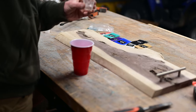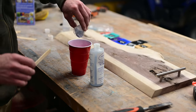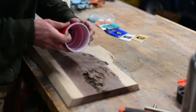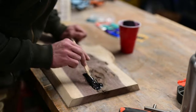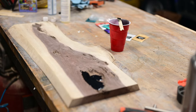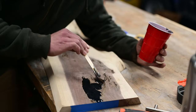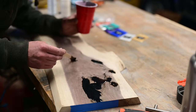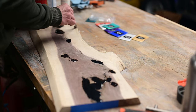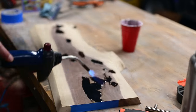There were a lot of voids on top of this board and I was going to use epoxy to fill them. I tinted the epoxy black and filled those voids. I was going to use a teal color, but I'm pretty plain Jane when it comes to this stuff and black epoxy just worked well for me — I didn't really want too much color contrast. There was already quite a bit of contrast from the sapwood; this was a pretty heavy sapwood piece. I went back with a torch to pop all the bubbles.